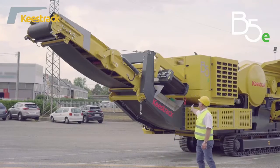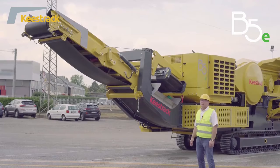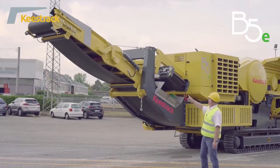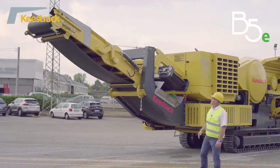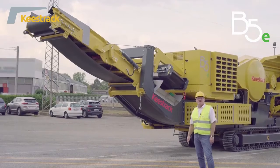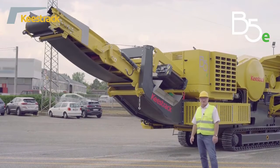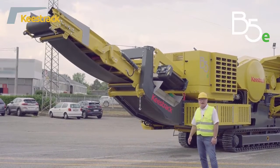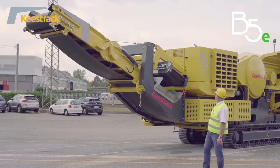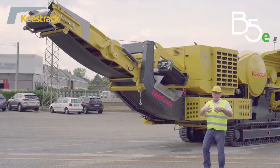So here we have the main conveyor for discharge of the crushed and pre-screened material on stockpile or to the built-on after screen. The main conveyor has a width of 1000 millimeter. There's an axle distance of 11.4 meter. It has a discharge height for stockpiling of 3.8 meters. It means we can make a stockpile of roughly 170 tons. In the bottom of the discharge conveyor, we have a damping zone. The rubber belt itself is a ripstop belt, and we have a guiding chute along the whole conveyor to avoid falling out of material.